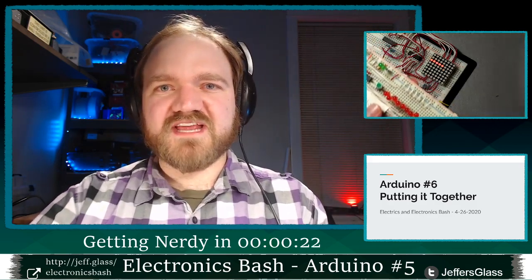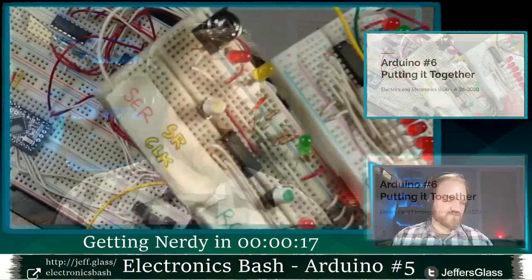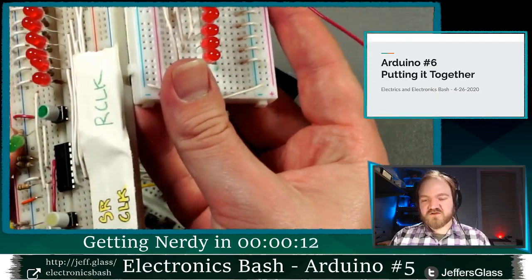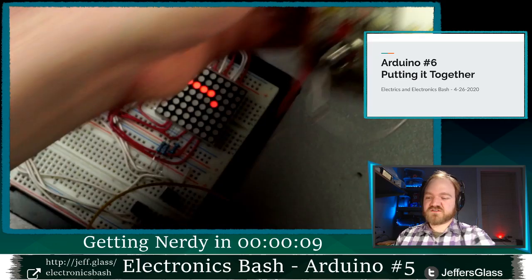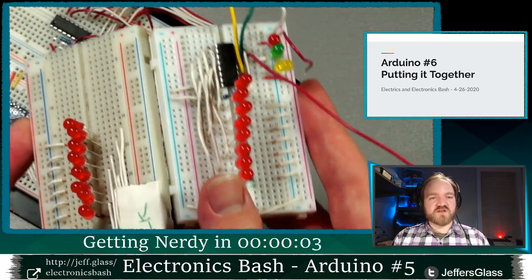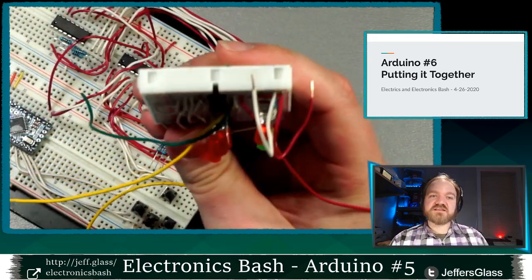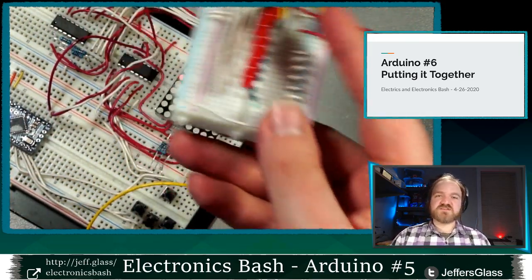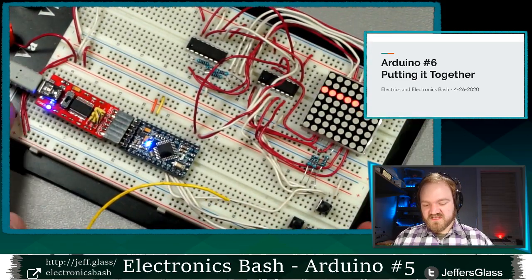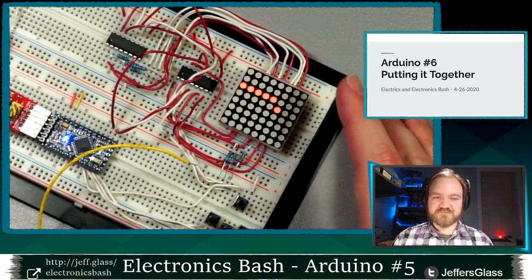Breadboards mostly, by the way, interlink together. If you have multiples of them, I don't know if we've talked about this, but a lot of them have these little tabs on the ends, which are meant to interlock with the tabs on adjacent breadboards, at least breadboards of the same size. Like, these two are two different size ones, so you see the tabs don't line up. But if I have two identical breadboards, I can lock them together and make a double width breadboard, or lock them end to end, you can see there as well, and make a double length one. So they're a little bit more configurable, which is nice. In fact, this on the table here, which is our end of the night demo, is two breadboards linked together in the middle here, and then they're just glued down to this piece of metal for convenience sake.